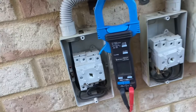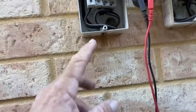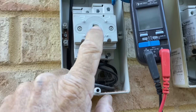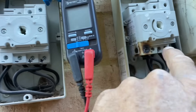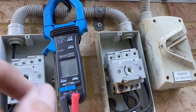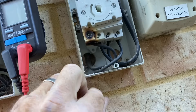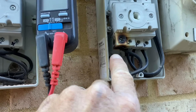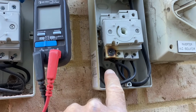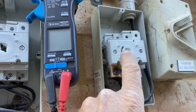In the process of testing this one, I didn't know what was positive and negative up on the roof, so I've done my terminations and thought I'd change it down here at the isolator if needed. As I checked the polarity, I discovered that this isolator — the one for the string that was burnt out — was still working, but it's only a matter of time until it possibly goes up like the one on the roof. That's probably because it wasn't terminated properly — it was probably loose. Over time it's been a hot joint, and that just escalates as it gets hotter: the resistance gets higher, it gets hotter, resistance gets higher, and eventually it'll either stop making contact or catch fire. So I'm going to have to replace that one too.